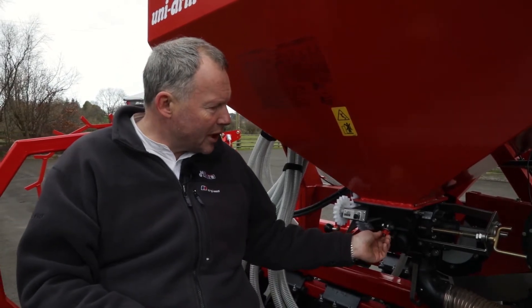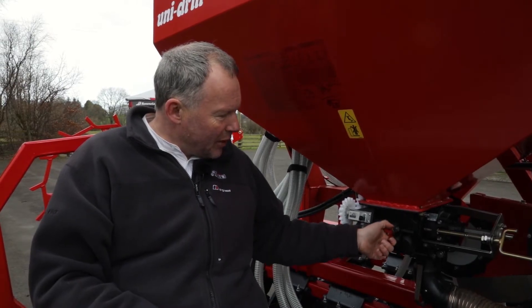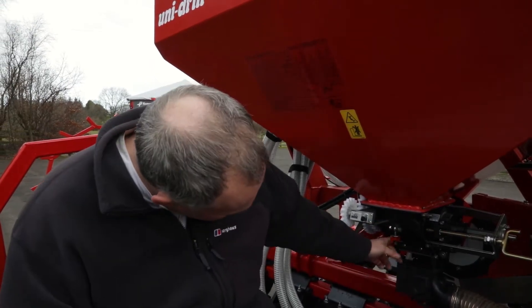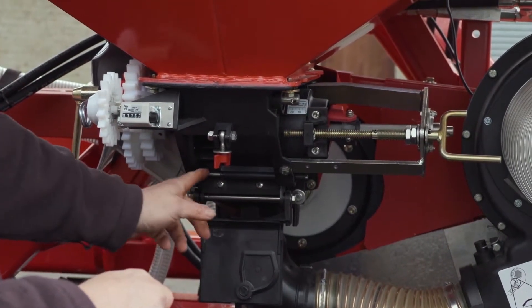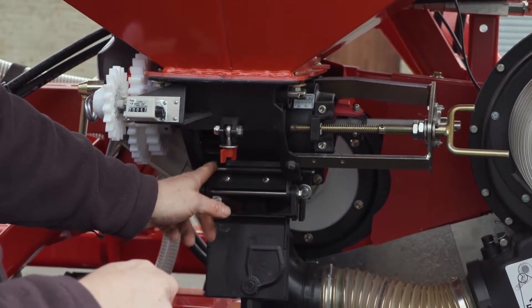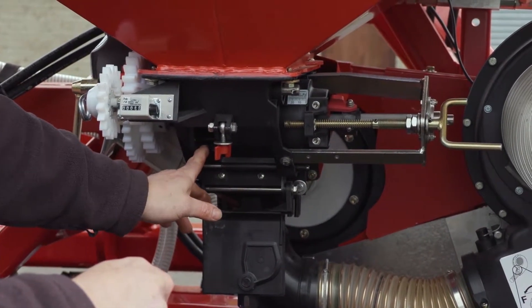The reality for me, mainly where I live around here, is doing grass seeds. There are a few little secrets for grass — if we open this up here you can see the metering wheel. I like to open up this aperture a lot wider, because at a normal grass seed setting there's not a lot of room here and grass can tend to bridge in there.